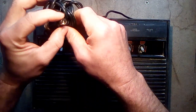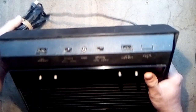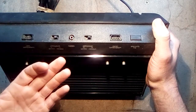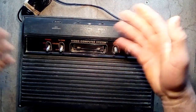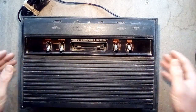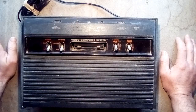Generally speaking it should just plug into the RF on the back of the older TV, tune in, and give you a picture when you power it on. It uses 9 volt DC, and when the 9 volts goes in it goes into one of those little 7805 regulators, so it's actually using 5 volts on the inside — taking 9 volts and turning it into 5 volts.